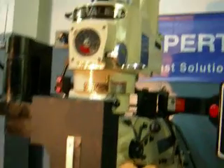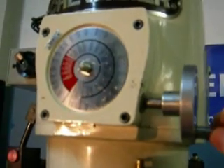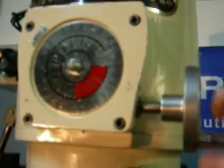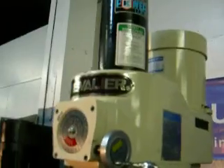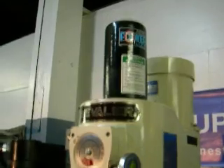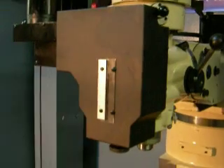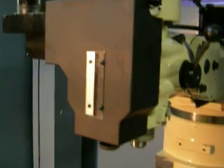As you can see it has the variable speed head — it's a 3 horsepower head. The head changes speed nicely. It's got the turret here, it's got the push button type drawbar on it, and it's got the Z-axis control, or the third axis control, on the quill.